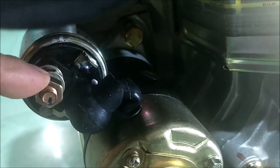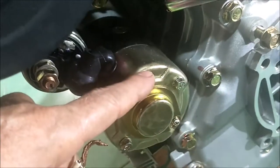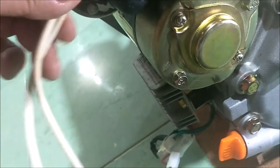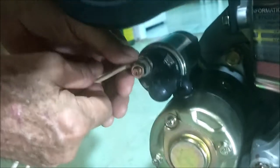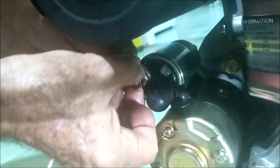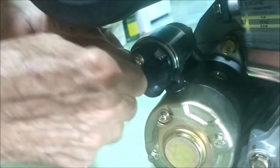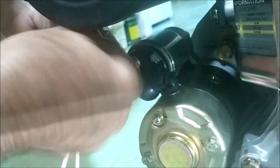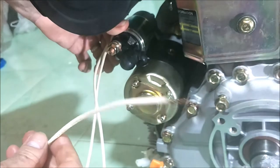Under here is your starter. This is your power terminal where the heavy wires go, because that's what runs the starter. There are washers you can use to keep the nut from twisting the wires when you tighten it. This is your power going to the starter. This little wire here is like your key switch — it's the ignition signal wire.